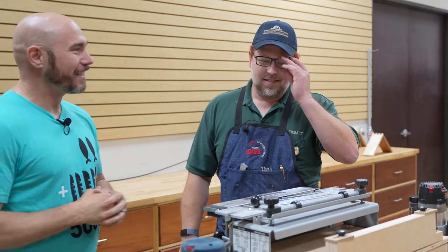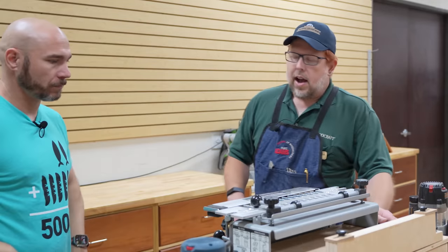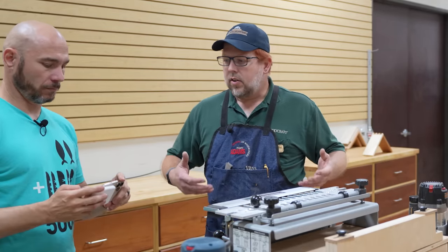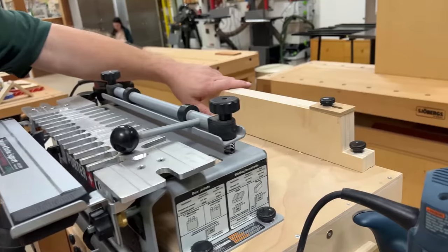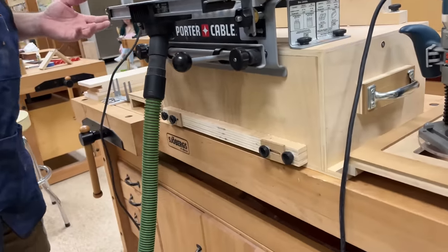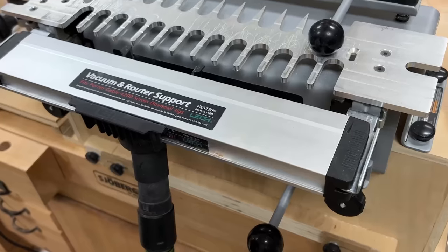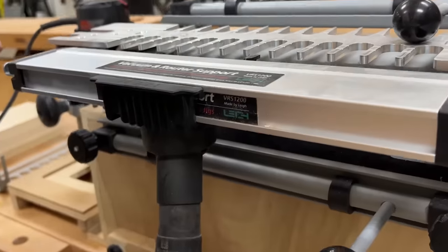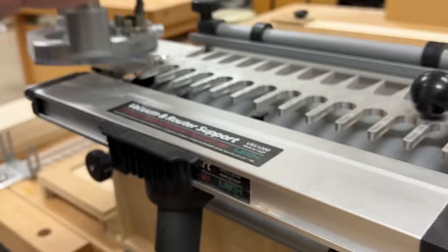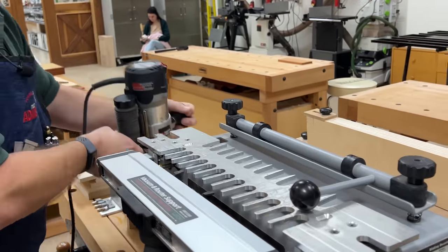This is probably the most interesting method for a power tool guy. A jig-on-a-jig box was built to get it up to a comfortable working height. It also has extra supports on the back and front, which is great for bigger drawers — helping support it properly and keeping everything square and tight. There's also an accessory from Lee Valley on the front that prevents the router from tipping, which keeps joints nice and crisp.